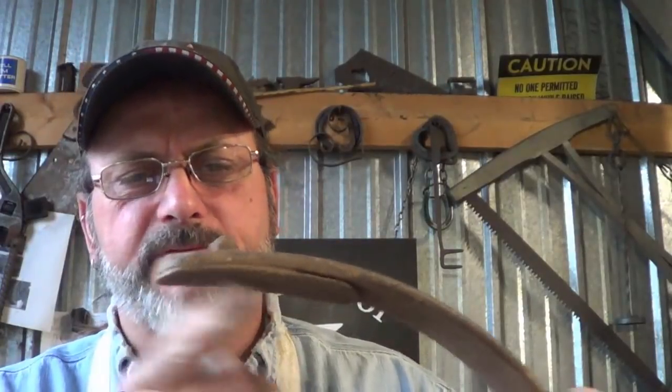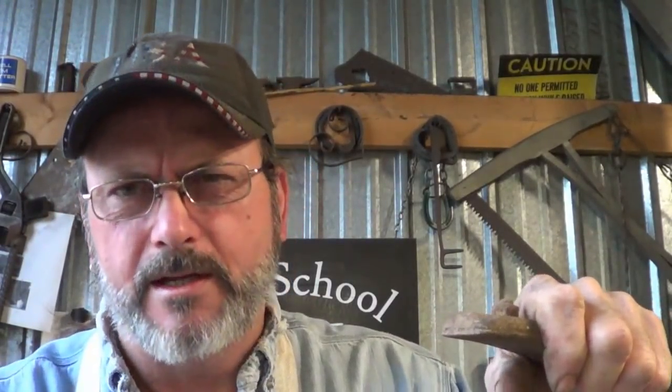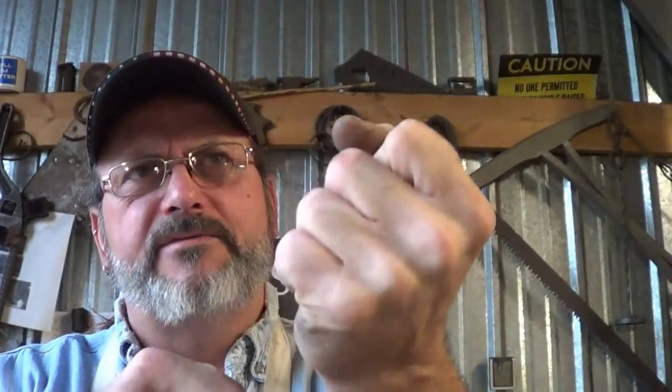So what I'm going to do is take off this sacrificial piece. I'll zip off about a half inch off the end here and measure that, just to get an idea of how much steel I'm going to need to get to that 6 pound weight. My quench for swords is only 32 inches, but with the Claymore, like William Wallace's, they have the leather wrap in front of the guard. So I'll figure 10 inches or so for that, which means I don't have to harden that much. We'll carve up 32 inches of it anywhere, and that's what I'll do on the grind. Let me get this figured out as far as how much we need.